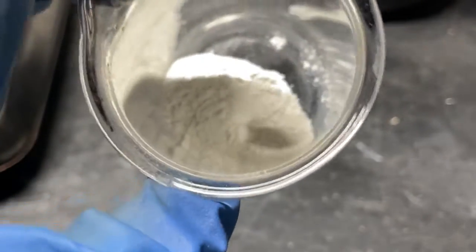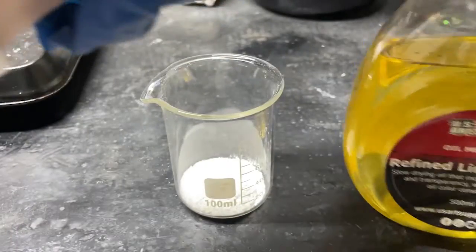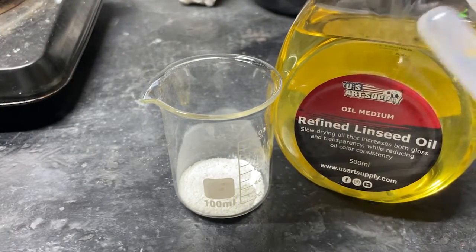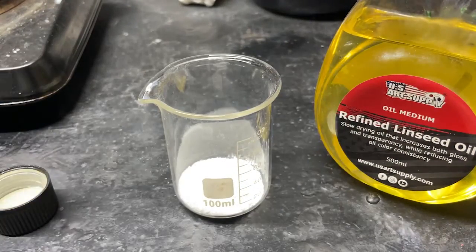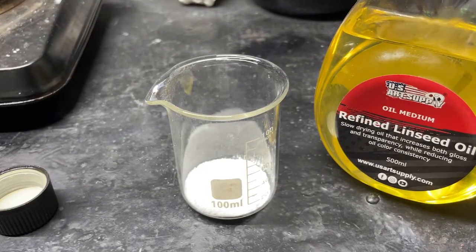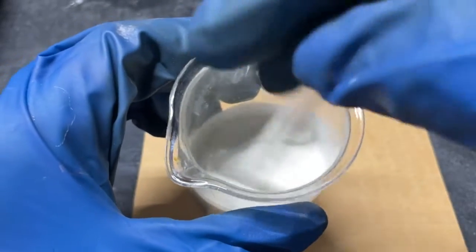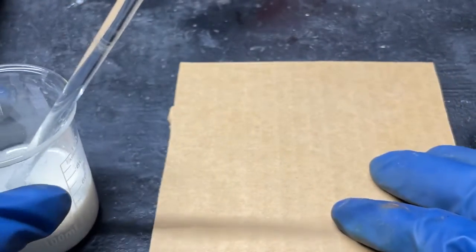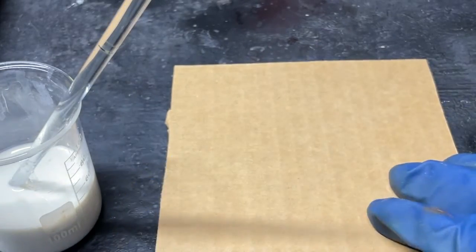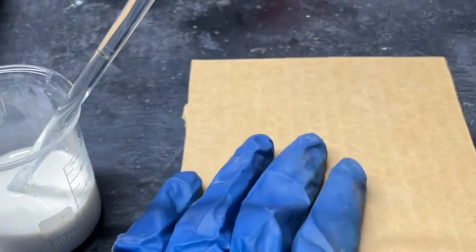From rock to pure white cadmium tungstate — that's actually really cool. I've never refined something from rock like that before. Now let's turn this into an x-ray intensifying screen. As our base we're going to use refined linseed oil, which will actually polymerize and harden — I've used it for my heavy metal paint series. I'm going to use this to apply it to our screen, essentially turning it into a paint. We're going to apply this to a piece of cardboard as the support — x-rays can pass pretty much straight through cardboard, so that will be a good backing.